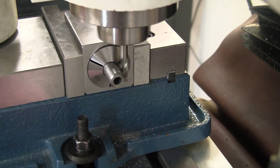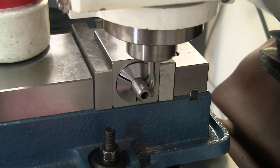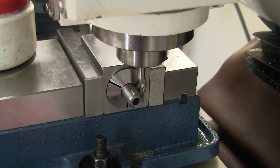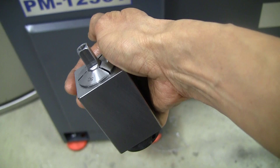Now over to the mill to make the square sides for the key to go into the chuck itself. I put it in a 1/2 inch 5C collet in a nice square collet holder — a couple of still photos, as the camera was a bit too shaky. It ends up making a very nice set of square sides; you just flip the thing over and off you go.